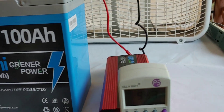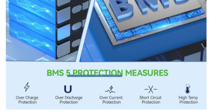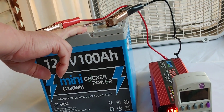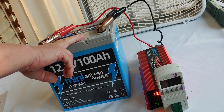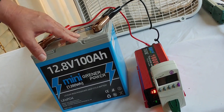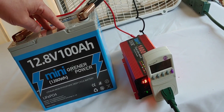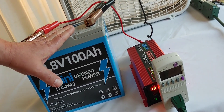These batteries have all the normal BMS protections you would expect: overcharge protection, over-discharge, overcurrent, short circuit, and over-temperature. I don't believe it has low-temperature protection — I couldn't find that. It has a five-year warranty, which is pretty good for a battery at this price point. And it will run up to 4,000 cycles, which means you can charge and discharge it every day, 365 days a year, for 10 years before it starts to lose capability — and even then it will only go down to about 80%. Also, you can put four of these in parallel and four in series, which is pretty standard for lithium batteries.